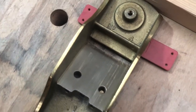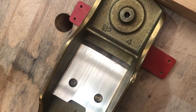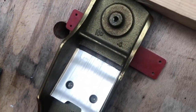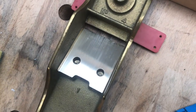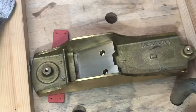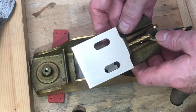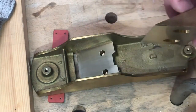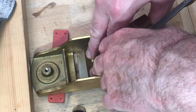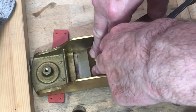The next stage is to change to 1500 grit paper and keep working to get a polish — and getting a much better polish, a lot more of the marks removed. Finally, we'll move up to 2500 grit paper, and that's a really good finish. Yes, it's shiny, which is lovely, but more importantly everything is smooth and flat. And because we used the frog as the grinding tool, both surfaces now match each other. After using the frog as a grinding tool I had to clean it up — I used solvent to get the glue off, then worked my way up the grits to polish it to match the ramp. The result is a really nice, silky, smooth fit.